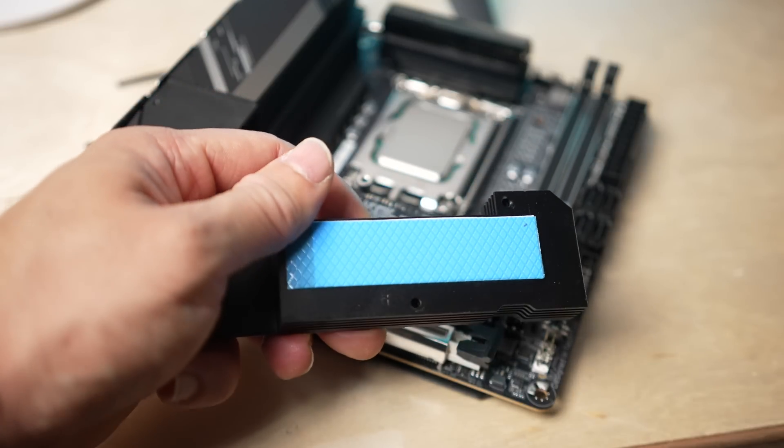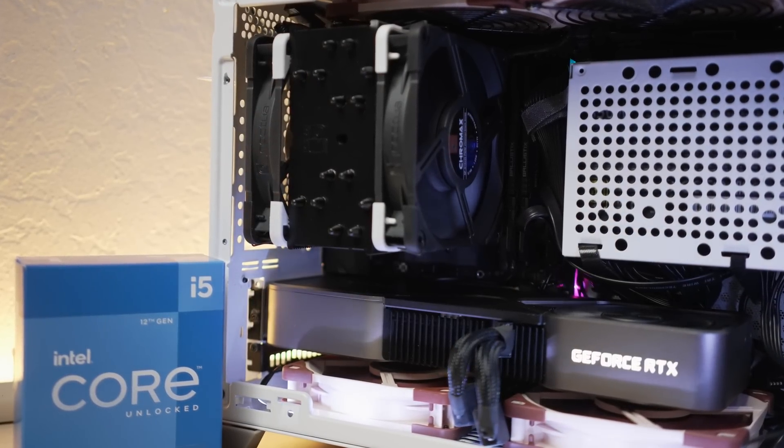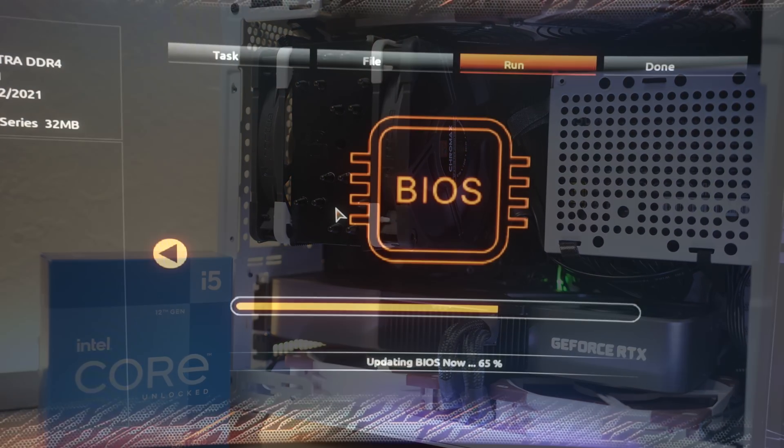This could have been mitigated by locating one of the drives on the back of the board — traditionally right there — which is how it's been done with other Gigabyte mini-ITX boards. That would have avoided the need for this super-tall assembly, which even as it is shouldn't need to be this big — even half the thickness would make coolers more compatible. Now for the ugly: I did the initial testing with a SATA SSD since the M.2 would not work out of the box and the drive would not detect on the first BIOS. After updating to the November 19th BIOS, there was a glimmer of hope — I did get the M.2 to work, but only when connected to an HDMI 2.0 monitor with no initial boot screen. On DisplayPort I got the boot screen but no M.2, and then after a few restarts on HDMI 2.0, the M.2 was now not detected again.